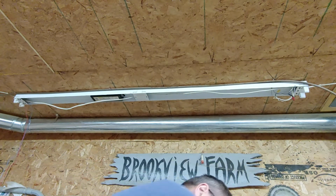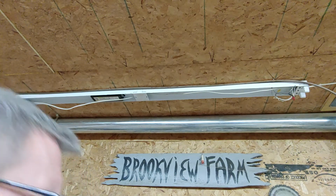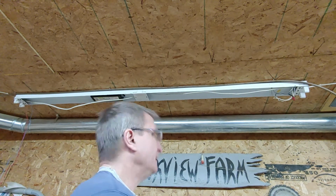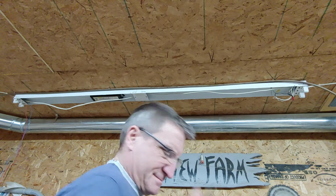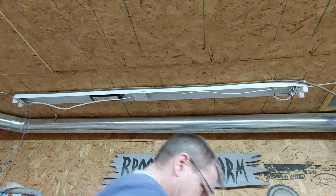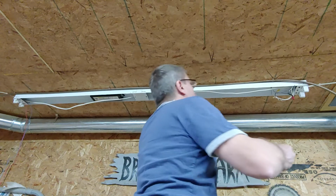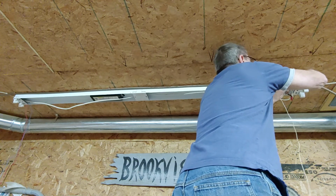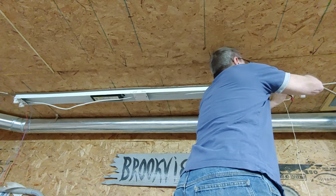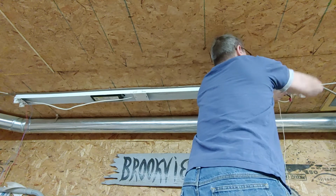So I'm going to need to add on a piece of wire. So I will just take this one I cut off, and hopefully it's long enough. Strip that. And that. Grab a yellow. Wire these two guys together. Again, this is my neutral coming in and my neutral coming out, and then just an extender to get me down to the red and blue on the other end, which are now going to be neutral.